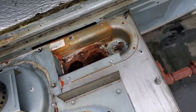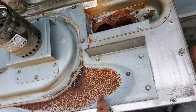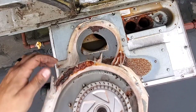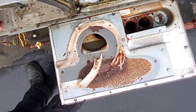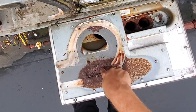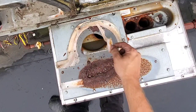While it's sitting here conveniently, I can remove this inducer fan and this little cover panel, which might prove to be so rusty it needs to be replaced - we'll see how it goes. That's our wheel, looking okay, nice and rusty. I don't know if the housing is still intact - barely. It's not good, man. There's a hole in this plate. We'll need to make a little piece of metal to patch that.